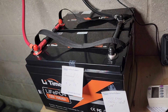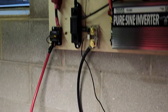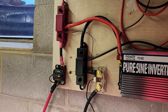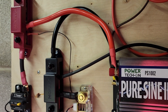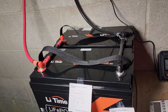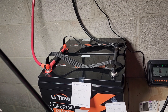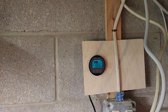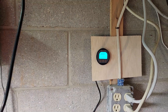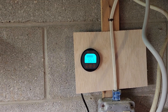The other downside: if you plug a charger directly onto the battery terminals rather than onto the bus bar or the upper terminal of the shunt, the charger bypasses the shunt and it can't measure the charge going into the battery. You would lose your calibration, so keep that in mind — if you make that mistake, you'll need to recalibrate the battery monitor.